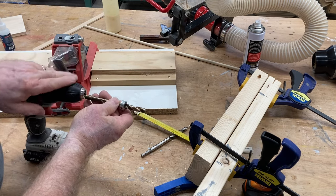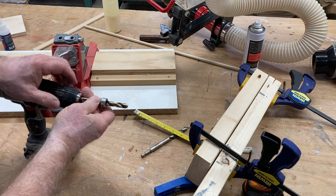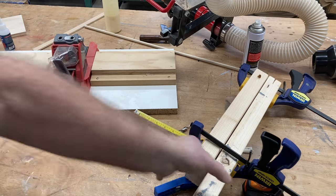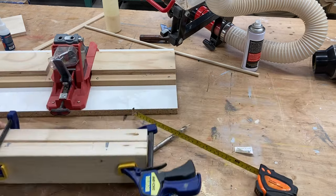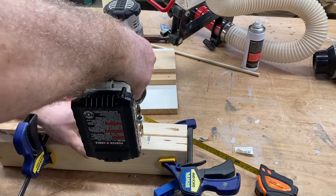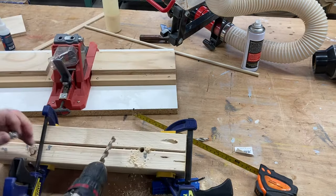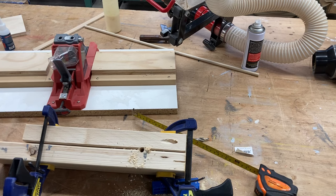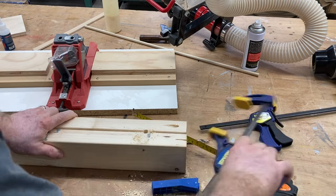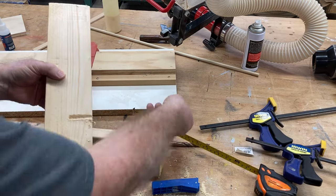You don't need the step drill for this. You want to have a good solid pocket that you can slide the dowel rod into to be able to cut out the proper length. Drilling the hole is actually the easy part. All I did is just drill that hole right between the two pieces of the 2x4. Separate the 2x4 and you have a completed jig. That slot is the easiest way to drill it, and now you have a depth gauge to cut the plug to the proper length.